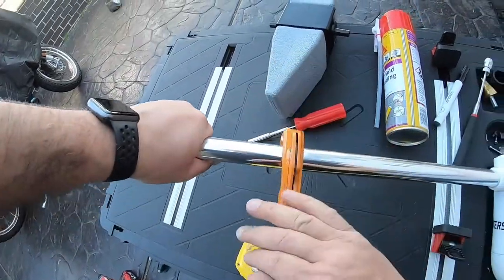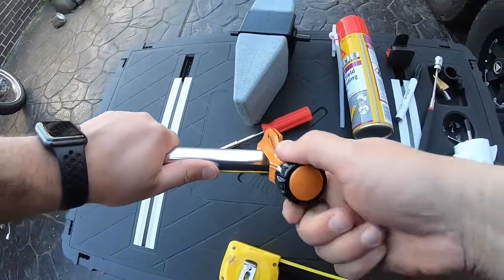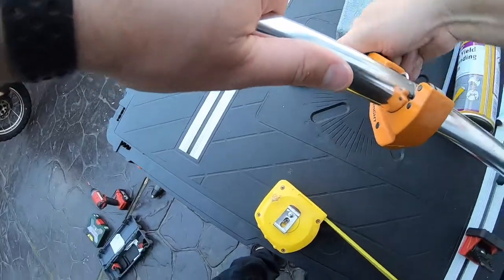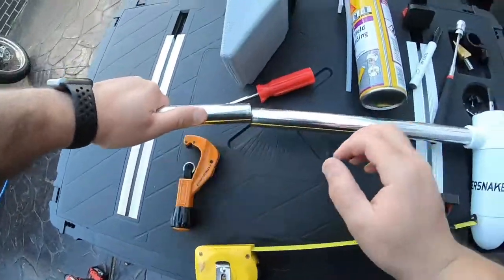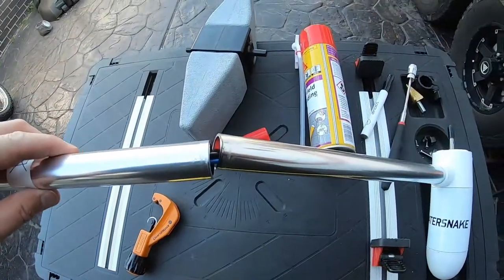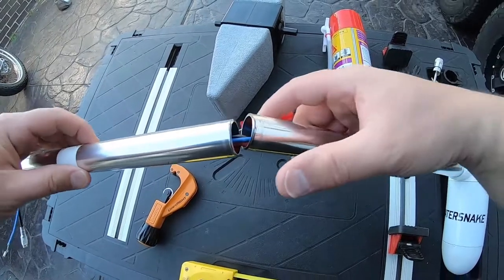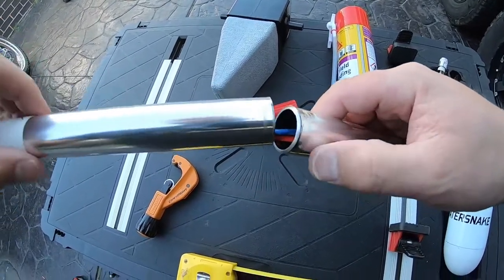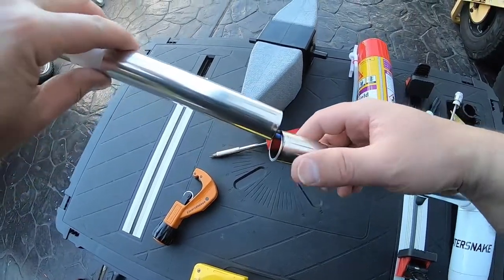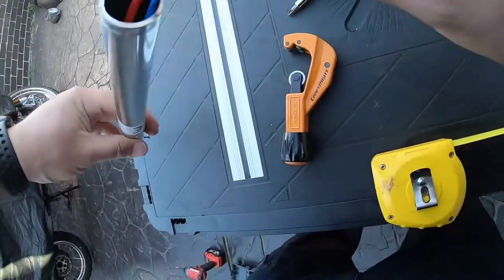Another tighten — so you do a revolution, tighten it a bit, and it's going to dig in slowly. There you go — you can see my wires are nicely intact. You didn't have to muck around with putting PVC pipe through there and it's a nice clean cut. Now just gently take the wires out from the top.